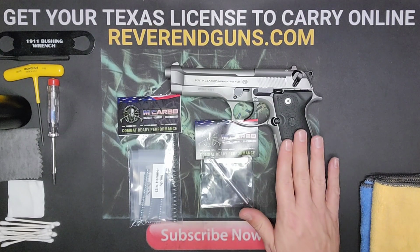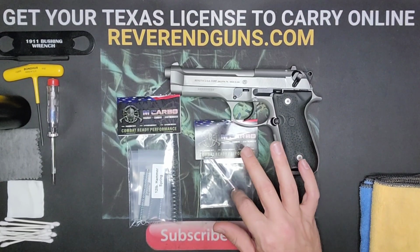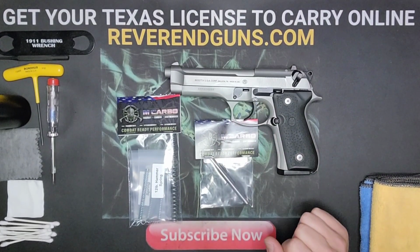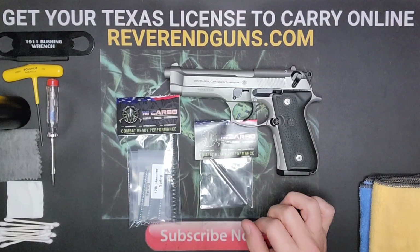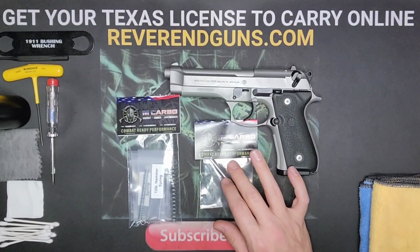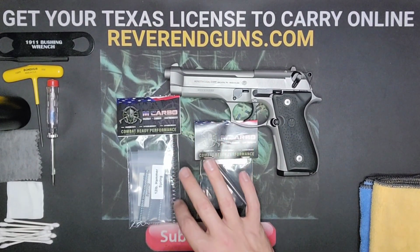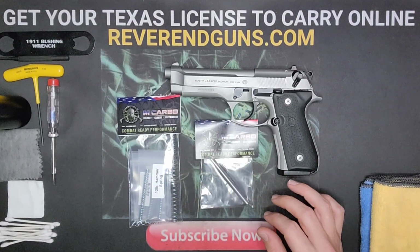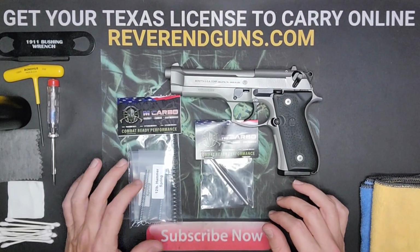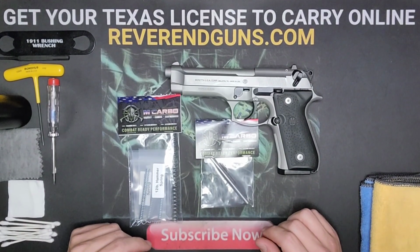Today we are going to be removing the guide rod and spring from this Beretta 92FS and installing it with the upgraded parts from MCARBO. You have to actually get this in two kits. One is the guide rod itself; it's stainless steel, and the guide rod spring is in their Pro Trigger kit. So I'll do the rest of the trigger kit on the next video.